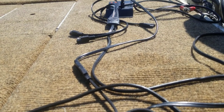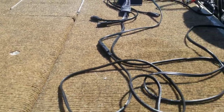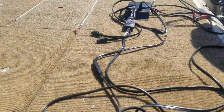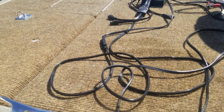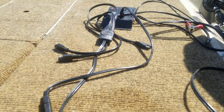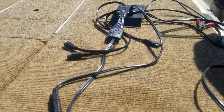Here's the voltage regulator I'll use with the four solar panels, since that's putting out 100 watts. That's going to charge two trolling motor batteries under there. I do have to do a little rewiring — switching from 24 volts to 12 volts, which is really simple using a set of jumper cables. That charger charges at 12 volts, and I've got 24 volts, so I'm charging two batteries in parallel.